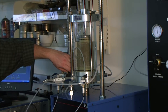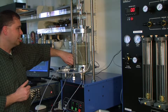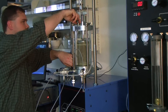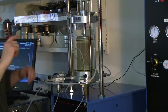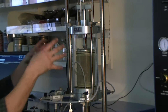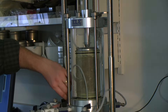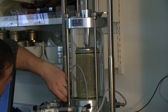We're filling the cell and allowing air to evacuate. What you want to avoid is closing this with the valve open, because that puts 59 psi — or whatever the line pressure is — onto the sample. You always want to close this valve when you get close to the top.